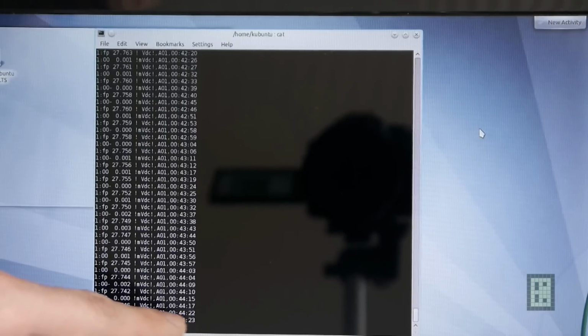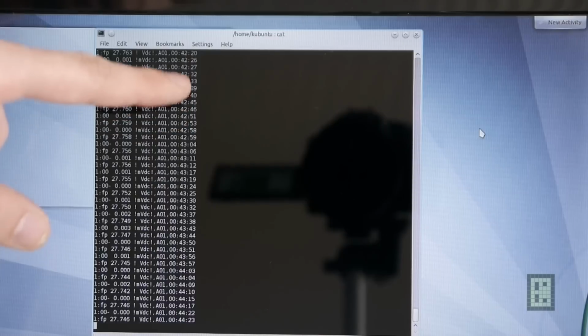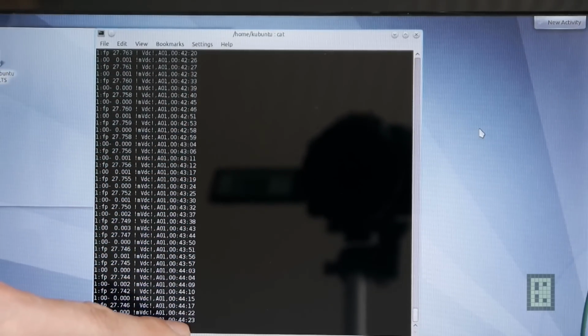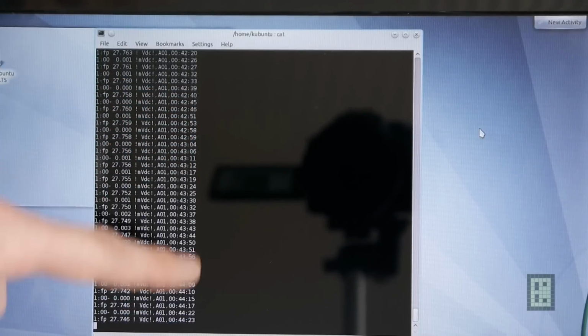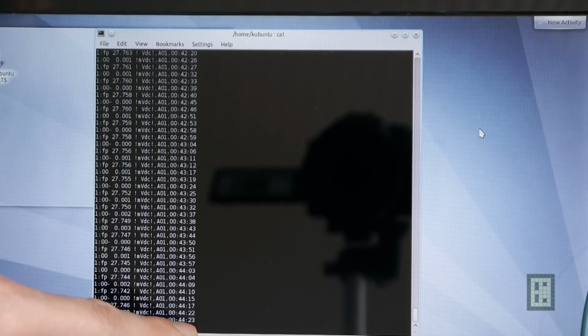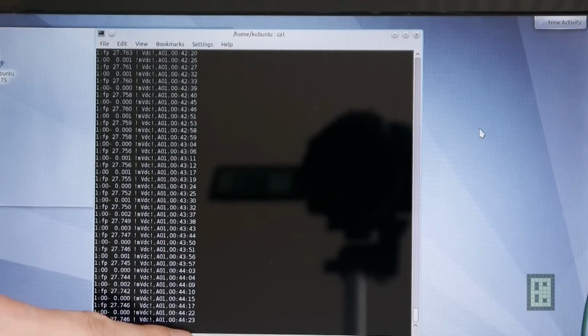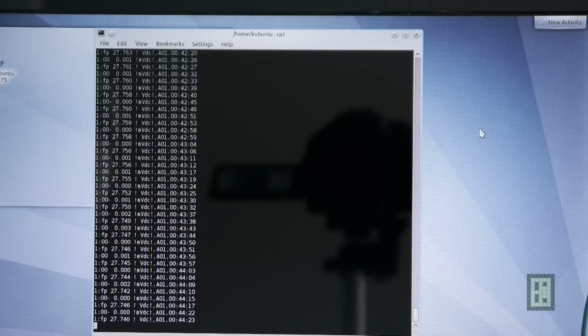They both are voltages, but one of them could be converted to current very easily, since that's what it represents. And what I also have is a timestamp, so I know exactly at which time I recorded the data. So I will need to modify this, because this was, I think, every 5 seconds, but probably every 20 seconds will be good enough to build a graph. So I will change this in the Wavetek, and then I will come back, connect everything, and I will show you the results.